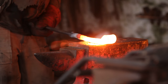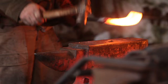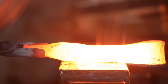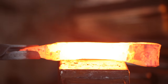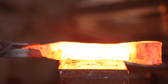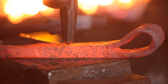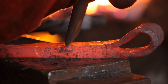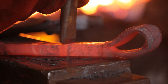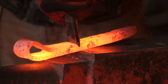This is my interpretation of the archaeology — I had a look at images and drawings of Viking shipwright's axes and this seems to be the way that a few of them were made. With it all welded I will blend in the edges and get that neck down to about an inch and an eighth by half to three-quarters of an inch thick. I cut it down at two and a half inches from the eye; I wish I'd done it at three to three and a half inches for more material for welding — a note for later.